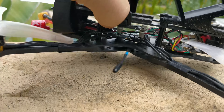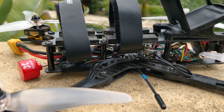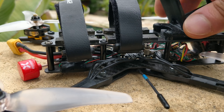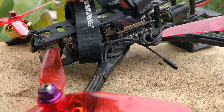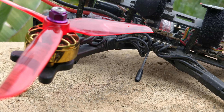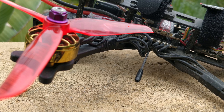I have the camera and flight controller up front, where there's plenty of room. The final version actually has a couple more millimeters of room up front than this prototype. I put the ESC in the middle with the VTX on top of the ESC, and then the Crossfire in the back with the antenna coming out the rear. The notch in the frame is specifically for your power cable to go up through the frame more easily, so shorter power cables work out more nicely.